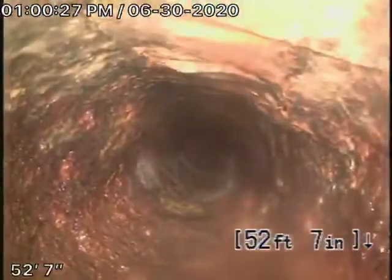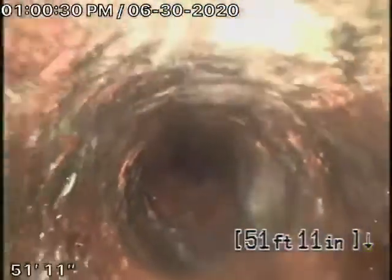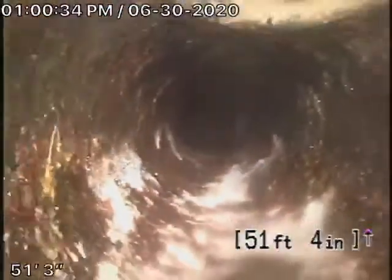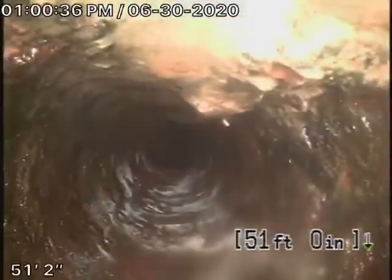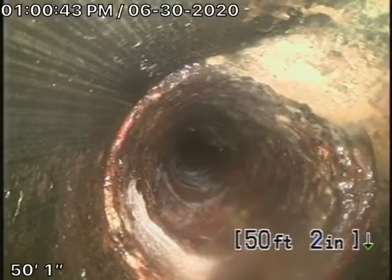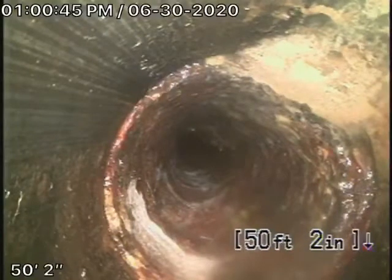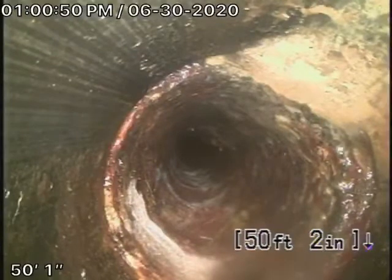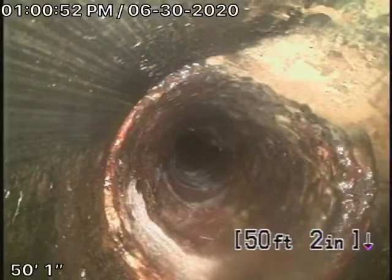This is very old piping. You'll want to have the general inspector check the plumbing underneath to see the condition of the piping. We're looking at the inside of the pipe — you cannot see the outside. There are roots in that cast iron pipe — nothing major, but they're there. You're either going to have to keep cleaning this, but we're going to recommend it be replaced.